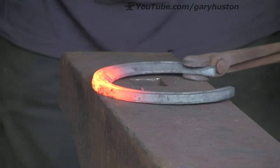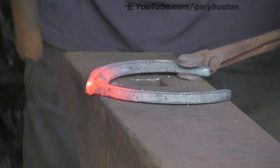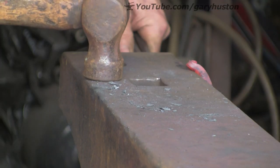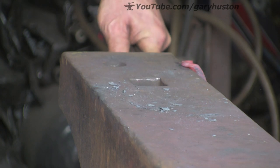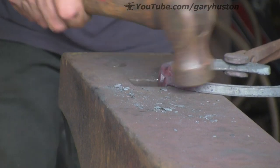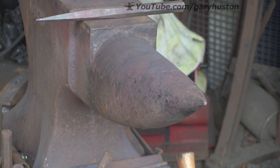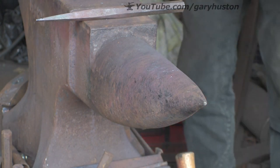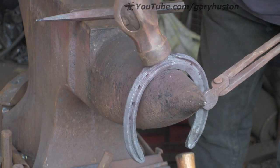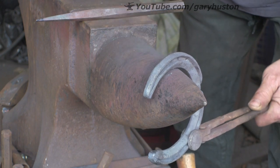Find my mark — slightly over the edge of the anvil, then just hit in the same spot until you've got a nice little lump. You don't want to go too far, otherwise you'll split right the way through into the fullering, which you don't really want. Pull it towards yourself — don't thin it out too much, leave a little bit of meat in there so it's got some strength. Tidy it up over the beak — knock that in if there's any distortion. Set the clip at an angle, just run around that edge — just finishes it off.